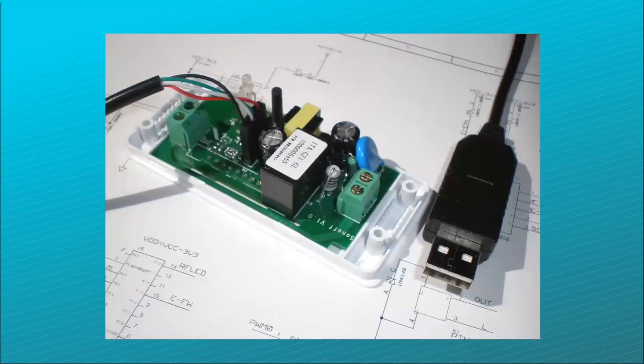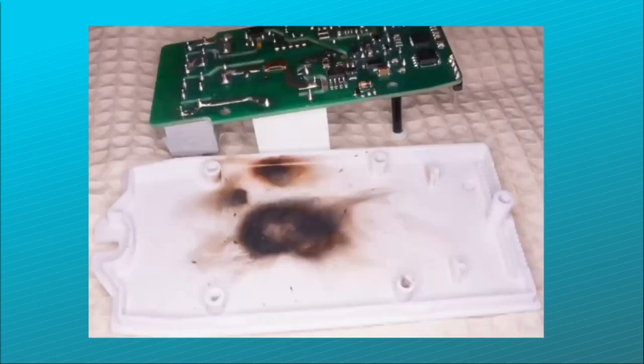All right, this is one of the basic modules from Sonoff, and this is being reprogrammed. What we have here is simply the Sonoff itself and a USB cable. You plug it into your laptop, you do the appropriate download of the code, and everything works fine. Do not plug this into the AC outlet while you have it plugged into your laptop, because you'll let the magic smoke out. It could destroy your laptop. These things are meant to be programmed via that USB cable. In most cases, the USB cable will provide you with enough power for it to be reprogrammed. Not all these devices need to be reprogrammed. It's just that some are there.